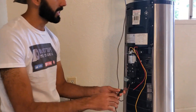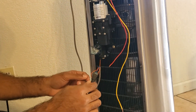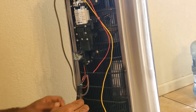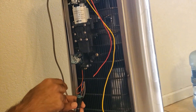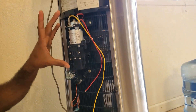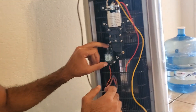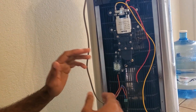So we've got the sensor all wired. We've got the brown going to the positive and the blue going to the negative of the power supply, and the black going to one leg of the relay. I've also added a jumper that goes from the positive of the power supply back to the relay. Now we're going to be wiring the pump to the relay, essentially wiring it in using the normally closed contact of the relay, so that when the trigger fires, the pump gets cut off.